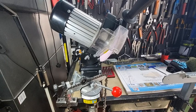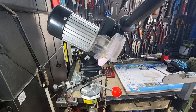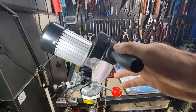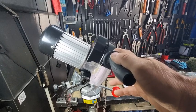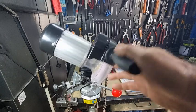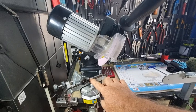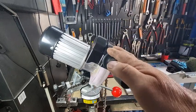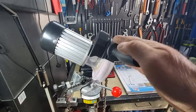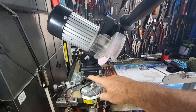One of the biggest mistakes people make with a grinder is bringing the grinding wheel down way too fast. When you bring the wheel down, just touch it — you can feel the resistance as it grinds into the tooth. Use a slight tap-on, tap-off motion; don't go too fast because you want to give the tooth at least half a second to cool down. Touch on, off, on — nice and slow. You might do that four or five times and that's it, and you should be able to put your finger on the tooth.